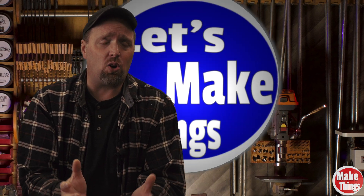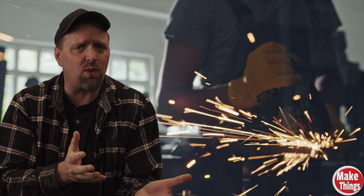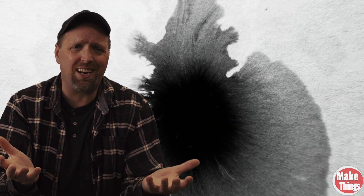Finally, we'll check how each machine does with engraving steel, using the logo from my second channel as the design. To prep the steel, I scuffed the surface to bare metal and added a layer of soot on top, since shiny steel doesn't do well unless you add a non-reflective layer. I left my speed at 20 and power at 100% — the highest power setting for each machine.